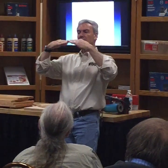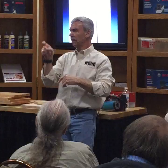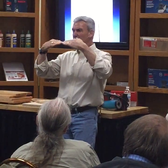In practice, when you clamp them together, they have a tendency to slide. That's that little knife, little edge you can feel. The more pressure, the worse it gets. But when they're 90 degrees, they butt. There's no slipping on it. So the point is, if you're making sure that you're going to joint something, make sure the blades are at